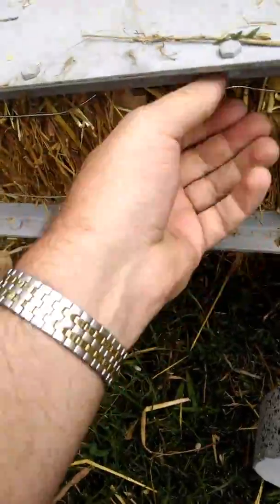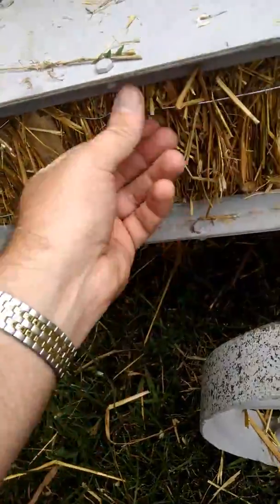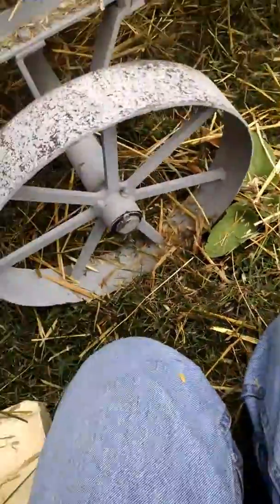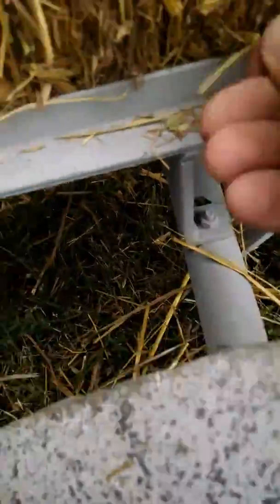And then we pull it through tight on one side, and then we get another length of wire for the second piece. And you always want to make sure you got enough wire, because if you don't have enough, you got to start all over and you wasted the first wire. So it looks like there's a little waste on this, but it's actually a pretty good process. If you've done a few bales, you kind of know what to do. So we feed this one through, and we straighten this wire out.